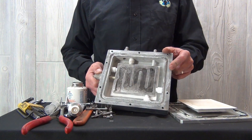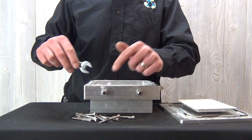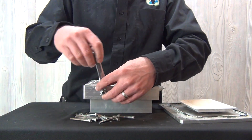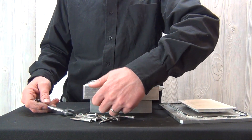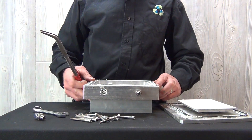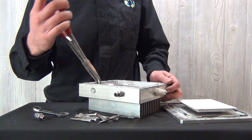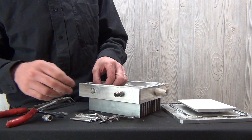At this time, we'll start to disassemble the inside of the end. We're going to take the ozone outlet fitting out with our 9/16-inch flat wrench. There is a Teflon spacer, or Teflon tube, inside that goes from the reactor plate out. That can be removed carefully with the needle-nose pliers.